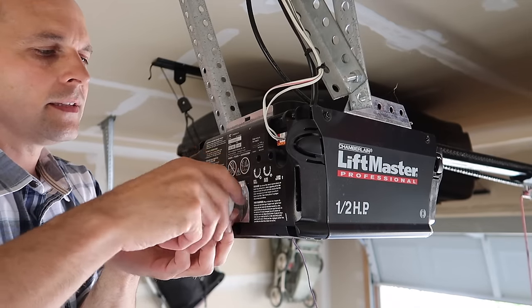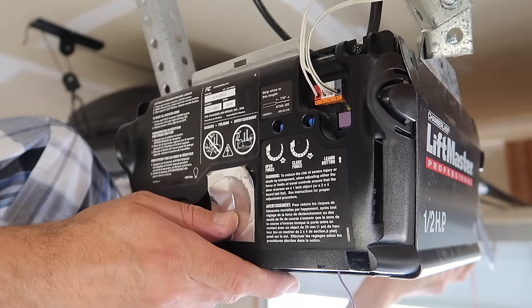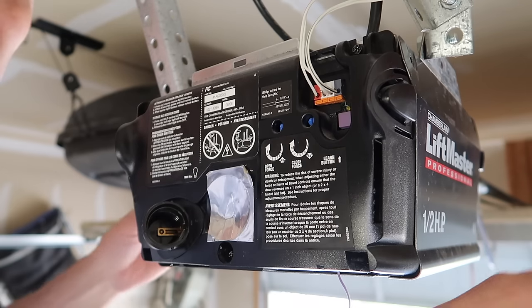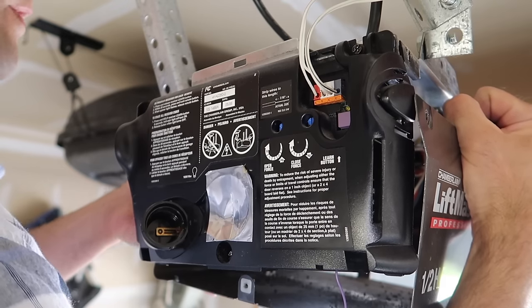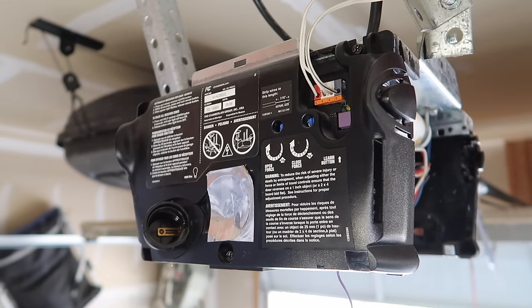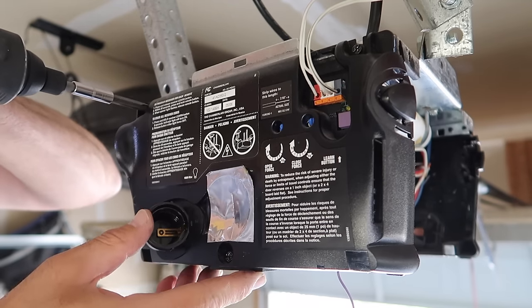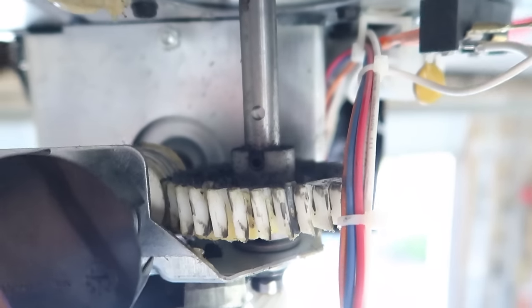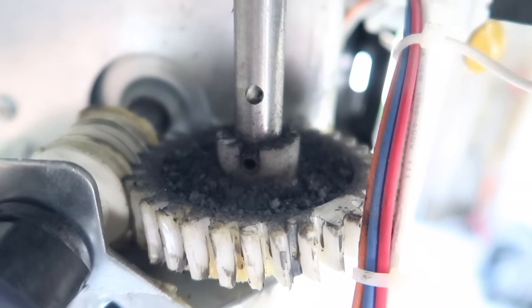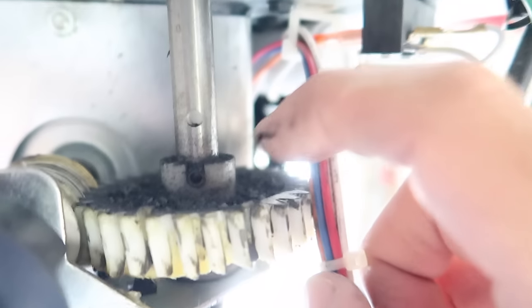Get this light bulb out of the way. Now there's this kind of sticky tape here that might cause trouble — it causes it to stick and not want to come off so easy. So just work that off. Taking a look inside, we can check the gears and see what condition they're in. On the top of this one, see all that dark ground-down material? That's all coming from this bushing up here — it all fell down and collected on there.